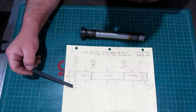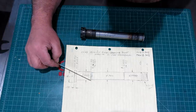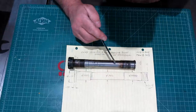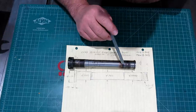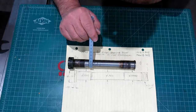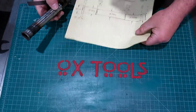There's a little reminder that that little flange is 118 thou thick that I need to check. The only thing that's a little bit weird is these transitions here - we want to use a tool that has a radius on it. This is fairly thin wall. The major stress is kind of at the journal areas. This just keeps the spacing, so it's not a highly stressed part. But we still want to simulate a little radius in there, just so there's not a sharp intersection. Let's go over to the lathe - we'll have some actual machining content on Ox Tools. How do you like that? It's been a while.